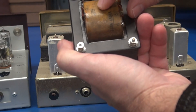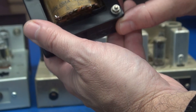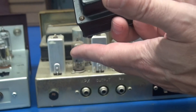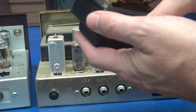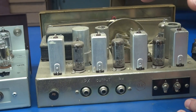Unfortunately, this power transformer does not have the output you need to drive an amplifier. It's got the 115-volt winding, but the high voltage section is only 125 volts, and you do have the 6.3-volt filament. This original transformer would probably be good to retrofit a hot chassis radio, but it will not work for the retrofit of the guitar amp.